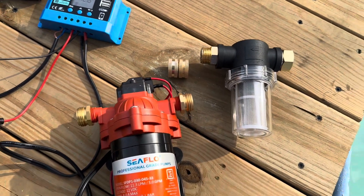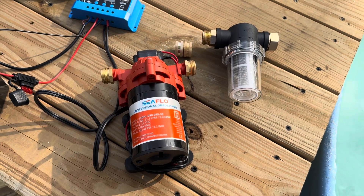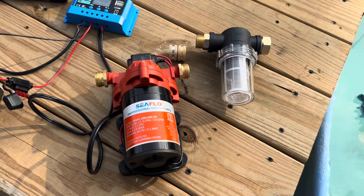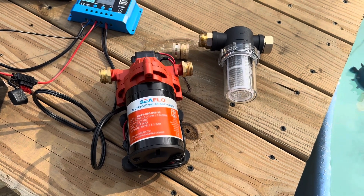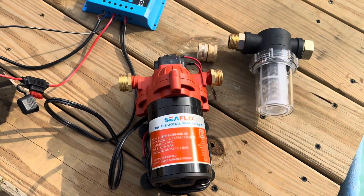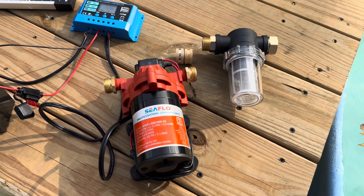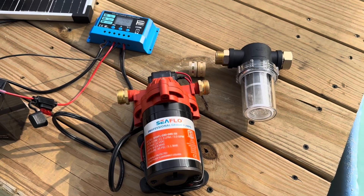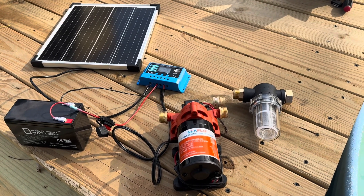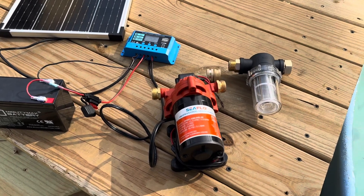It's going to run until it achieves a pressure of 45 PSI on the output end, then it uses this little pressure switch at the top to cut itself off, which is super nice. So if you have your hose out with a nozzle on it, you turn on the pump, it pressurizes the hose to 45 PSI, and then the pump cuts off without burning itself up. When you open the nozzle to water your plants or wash your car, it senses the pressure drop and automatically kicks on to provide water — that's the on-demand pump. I'll link all these components in the description. Everything together was just about $100, which is not bad at all.